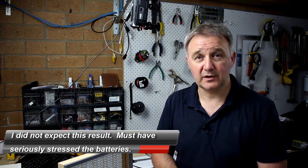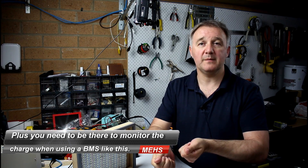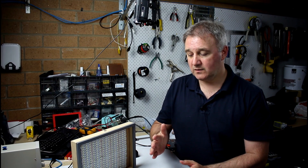So that worked. You got a 35 minute run time being charged through that little BMS board and a 25 minute run time through batteries being properly charged. There is a risk that you're overcharging, stressing, and possibly not taking every safety precaution by charging them rough and raw using a lab power supply or a 12 volt external brick - dumping it through the BMS, which just sends roughly 4.2 volts to each cell at an unlimited amount of current based on what the board can handle. The proper charging methodology is designed to be within all safety considerations and limits and to make those batteries last as long as they possibly can.